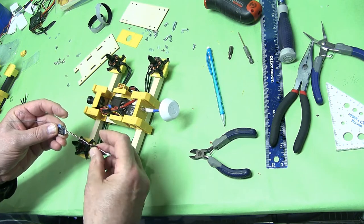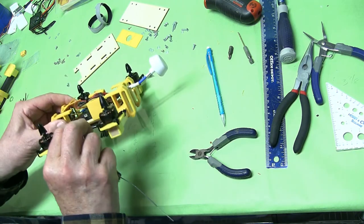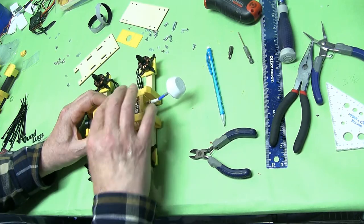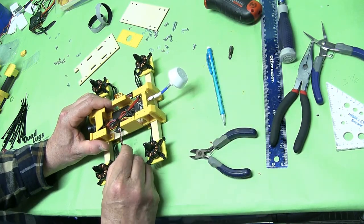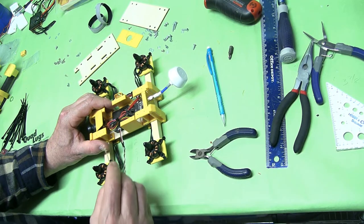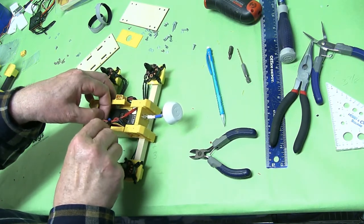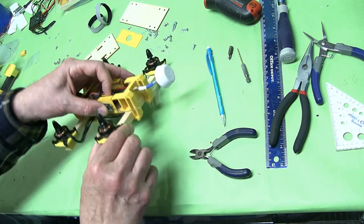It's key to get polarity right — ground, power, and your iBUS signal. There we go. We're going to plug in to the flex port. On this plug we're using the ground, the positive, then we skip one wire and use the signal wire here.